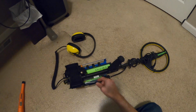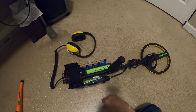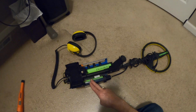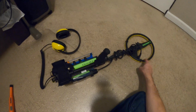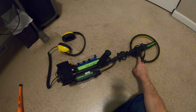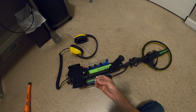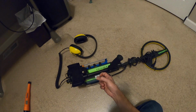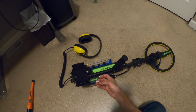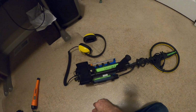And I turned off the power, turned the power back on, and the machine didn't come back on. The switch opened back up. I put the magnet on it, close the switch, take the magnet away, and it stayed closed. The signal coming out of the metal detector actually was enough in the circuit to cause this switch to be energized, basically with the magnetic, closing the magnetic contacts, the reed switch. So out with that. That technology is not going to work.